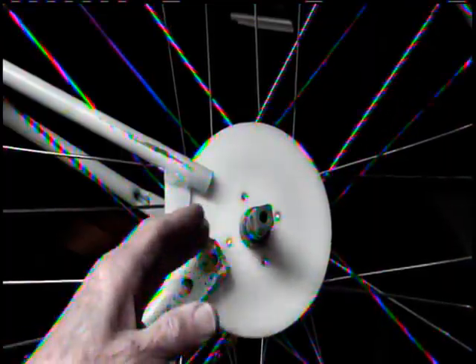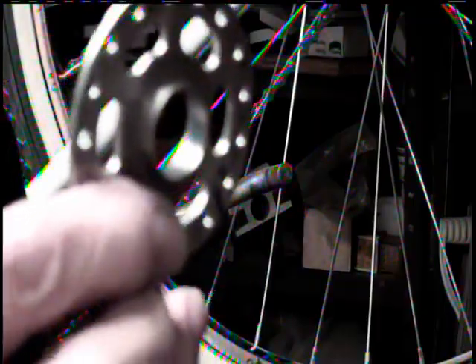To create a completely new hub, here's a spoke flange and the axle that goes through it. I had to put a Woodruff key slot in there to mount the bearing — it's assembled in now. It's a one-way bearing: when you turn it one way it's loose, and when you go the other way it rotates the outer bearing race. That was critical to making this work.